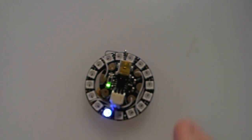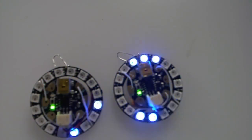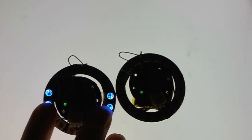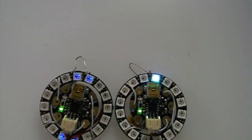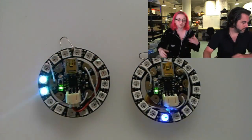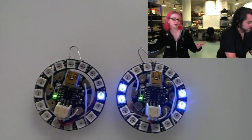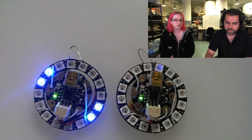You can see the LEDs — the chip inside. These are basically little earrings that she made. They have a Gemma on the inside, a NeoPixel ring, and then a little battery on the back. This is something that can run for a couple hours — it's really small and really simple. It's basically the same as the code that Phil B. wrote for the goggles, in an earring mode. So you can change the colors and reprogram it over USB. It's not as powerful as the Flora, but for something as simple as this — a simple project — it's only $8 and it uses a lot less power. It's really good for little projects.